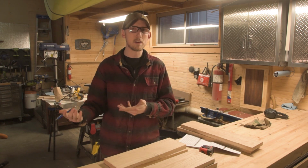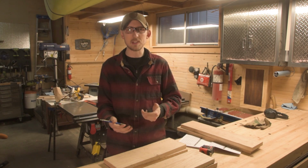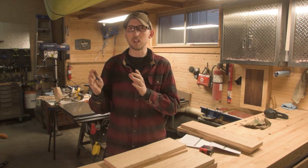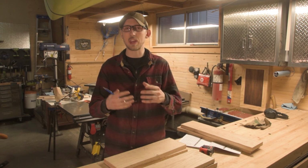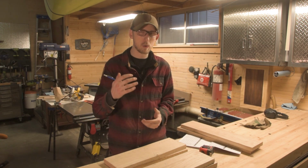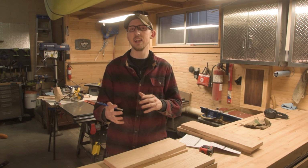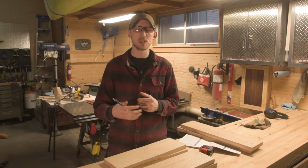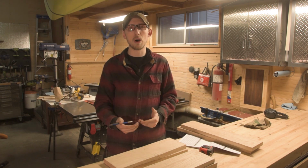So what we're going for in this project is fairly peak efficiency. Because I'm building 5 pieces overall here, it's going to be challenging enough getting all 5 of those pieces together, let alone if I just built each one individually. And also because I went through and actually spent the time designing these things so they have a lot of common pieces, that's just going to make my life easier. So what I want to make sure I'm doing is any common widths, any common pieces, sizes, whatever like that, I want to make sure that I'm cutting them and setting up the machines one time to make that specific cut or size or whatever component.